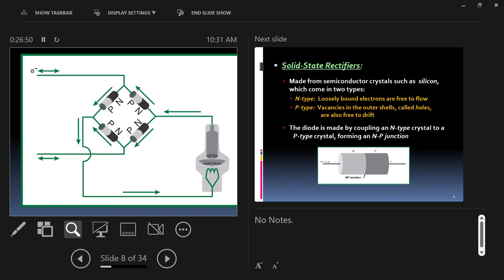Electricity can only travel one way. For some period of time the electricity was traveling that direction, but then the alternating current flips around and goes the other way. Now current's going to try to come in from the bottom and go up — it's going to want to go both directions. But the diode only allows it to go to the left. This diode on the right is functioning like an insulator at this moment, while this diode is functioning as a conductor. As the current shifts back and forth, these diodes switch roles between conductor and insulator.